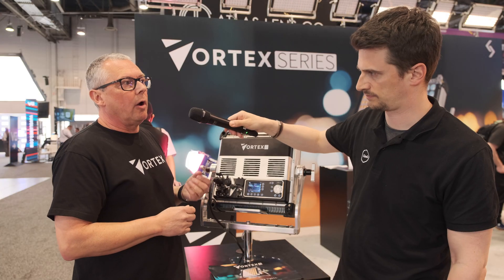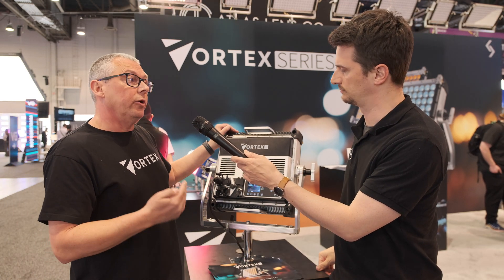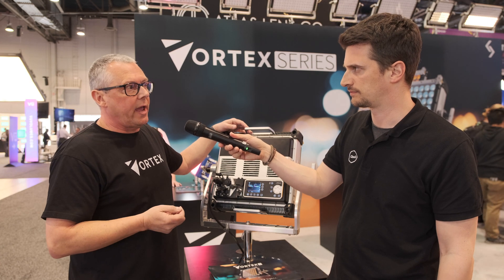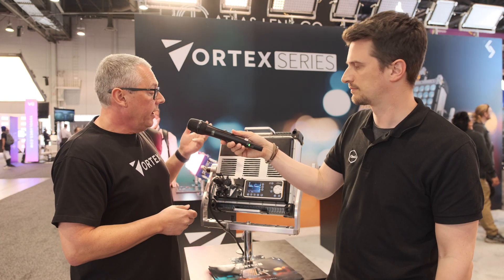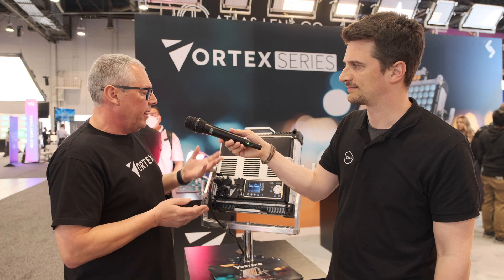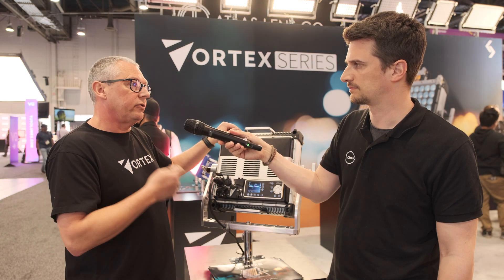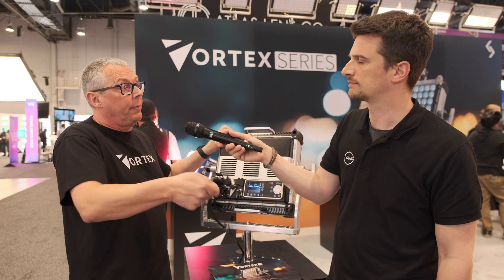On a more technical level for larger scale productions, the new firmware update adds RDM over fixed DMX cabling or over CRMX, plus DMX presets — so you can configure a really complicated multi-flex DMX mode, quickly save it, and switch to another preset. Also on the latest update, USB now has power to the port, and you can store individual show files or copy the entire file memory from one fixture — be it a four or an eight — straight onto another fixture.